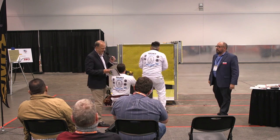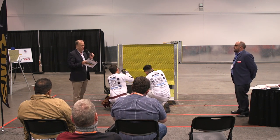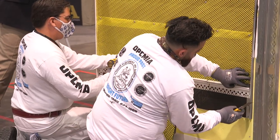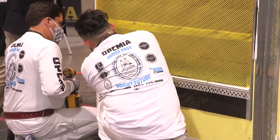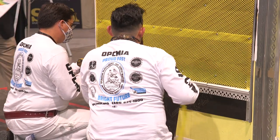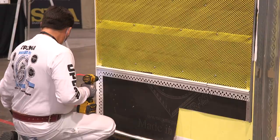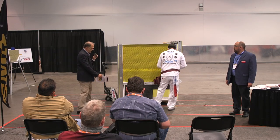One question I get asked a lot is: what happens if they screw this down and crush that mat behind it? It is possible to screw this down and put a crimp into that drain mat. But water is not going to say it can't go anywhere. It just goes right around. Water is insidious — it never takes a day off. That's why it's really important to make sure we get these flashings right.